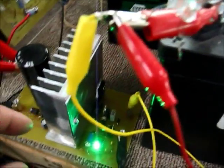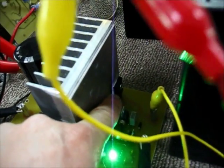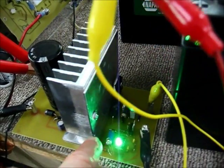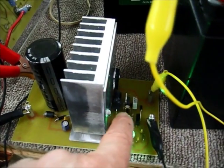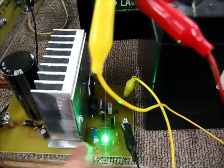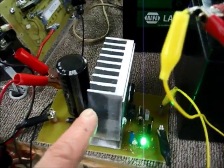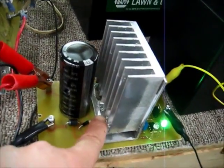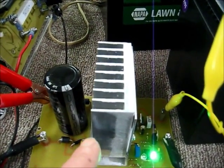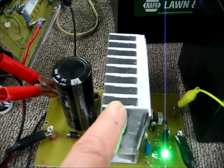It's kind of hard to see over here, but here's the amplifier itself — the device for the amplifier. And then the linear circuits are over here. And then the comparator circuits are over here. And once again, underneath here are TO3 devices, and they make up this series pass Darlington, basically. And then the filter.